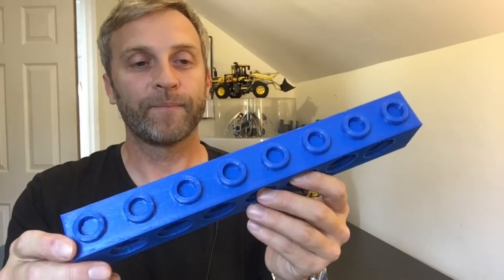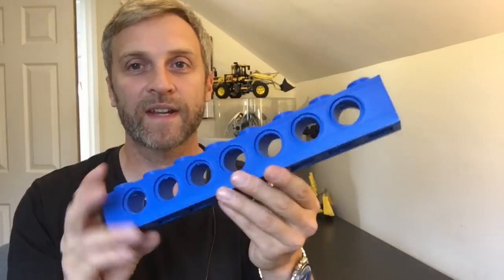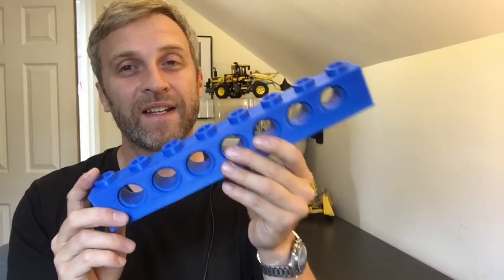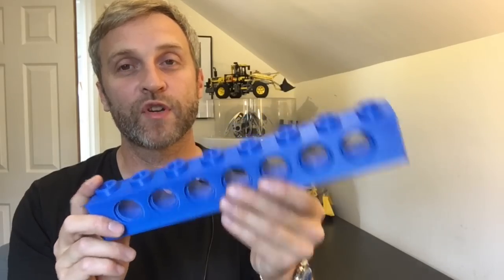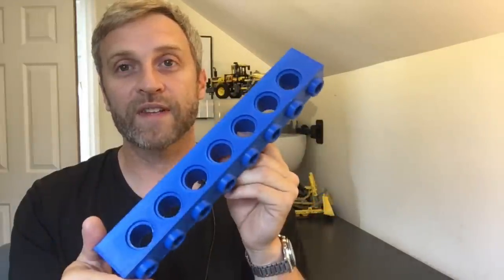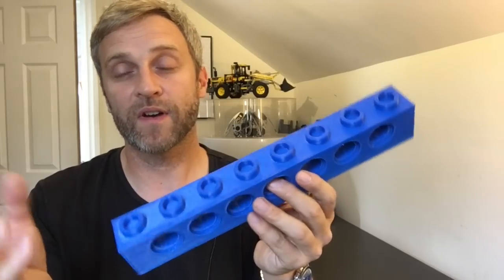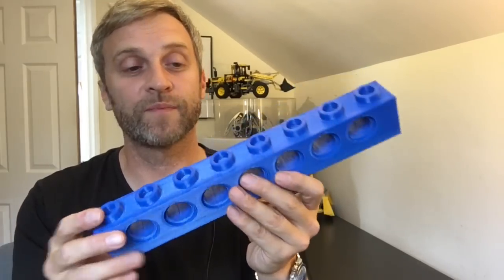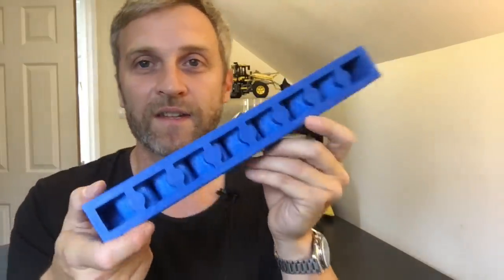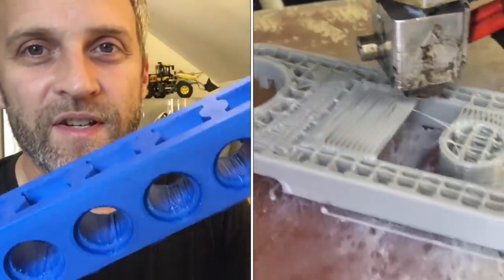The other tricky part was the large technical bricks. I should say that all of these parts are pretty much 20% infill, and most of them are two perimeter layers only — again for speed. I printed all of this at 0.4mm layer height, and it's on my Lulzbot TAZ 5 which has a 0.5mm nozzle.